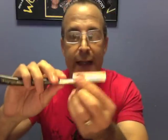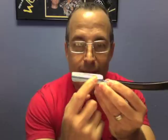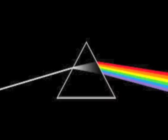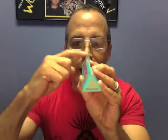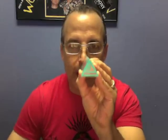Next: what does setting the bevel mean? What are we trying to accomplish? We're trying to get that plane flat. We get this plane absolutely flat, and those two planes come together and form a point — but it's not just a point. It's a three-dimensional shape, a triangular shape. And that shape is called — I didn't know what it was either, I had to ask my son — a triangular prism. Or the box of Toblerone. That's what setting the bevel is: it forms a point, that point forms a line, and that line is your shaving edge.